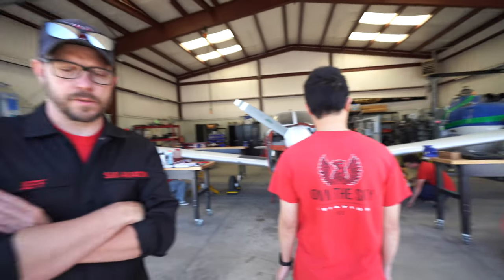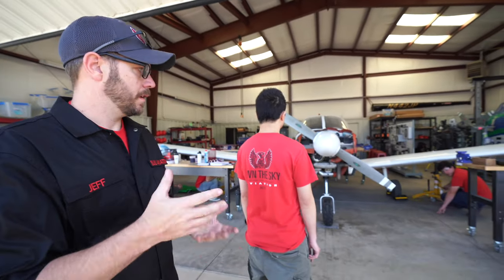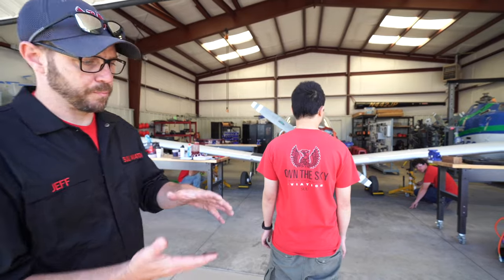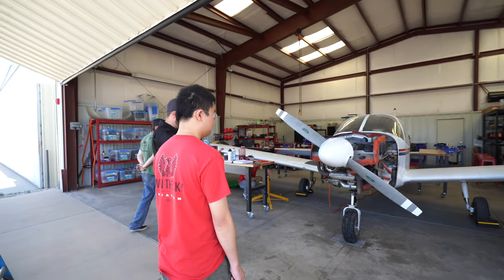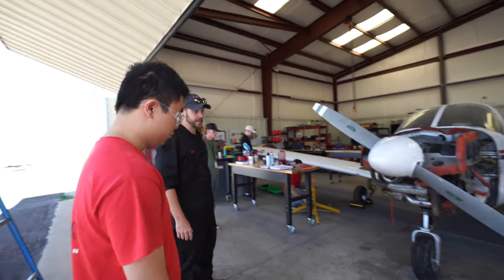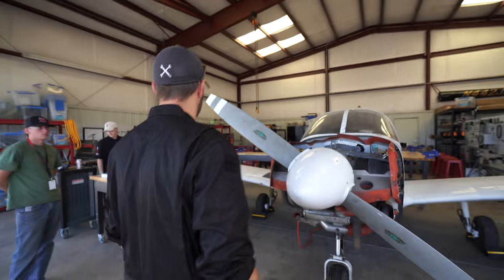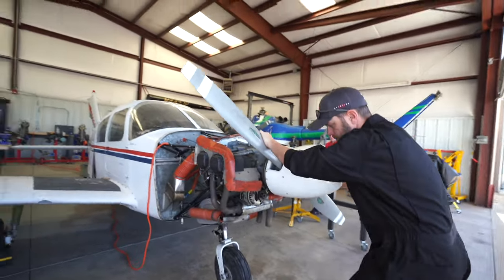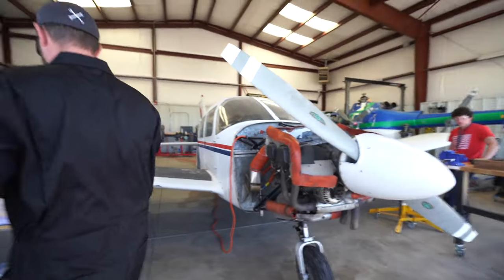You're going to notice that the struts will start to settle and they'll start to creak and pop, and you'll hear thuds and knocks and all that. Good. That's just them compressing. The mains and the nose are going to compress. All right. So everything out from underneath the aircraft. We don't want it to settle on anything right now. Another thing we can do, so everybody watch out, is you take the aircraft. You saw that thing come down. Man, we're close. Yeah. We're real close.